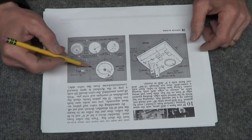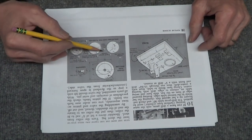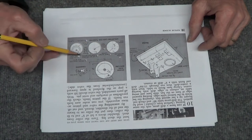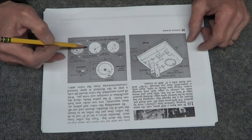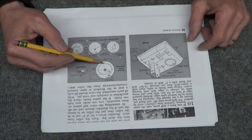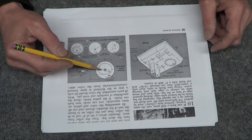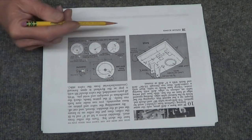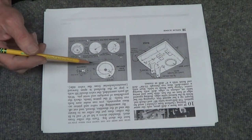Should be 1 11/64, but I was looking at how they're doing this. You take a disc, you measure offset, drill a hole, mount a 1.5-inch disc there, stick the whole thing in the lathe, and start spinning it until you get 1 11/16 here. I did that, but boy, is it so out of balance, the whole lathe is boom, boom, boom. You had to go so slow you could count the revolutions on it.